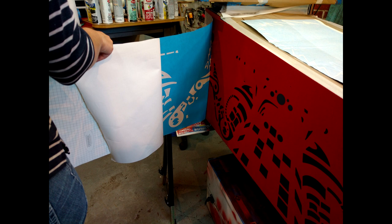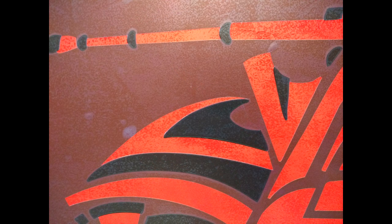So you lay down your first stencil and make sure those marks are where they need to be on the cabinet. For the second layer, the registration marks are in the same place, but you have to be really careful that they line up — you can't get the stencil halfway on and then go 'oh, we're wrong' and peel it off, because you'd screw it all up. You have to take some extra care with stencil work just to make sure everything is going to line up well. I got my second layer on and in these pictures you can see I got the registration dead to rights — almost perfect — on both sides.